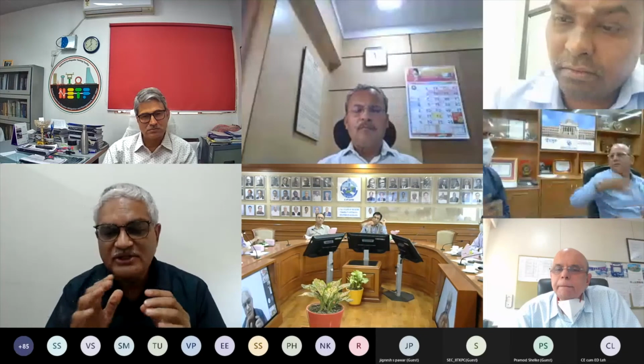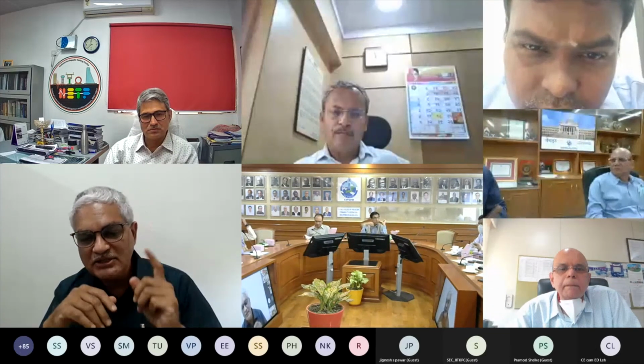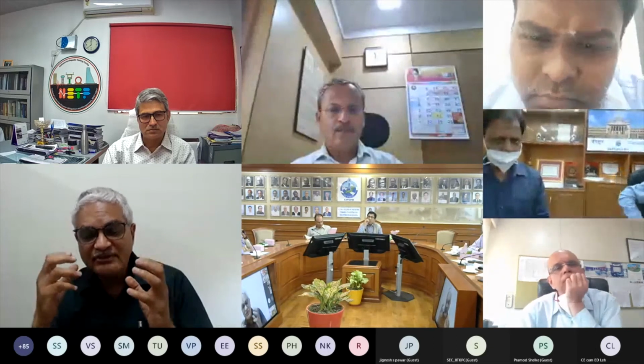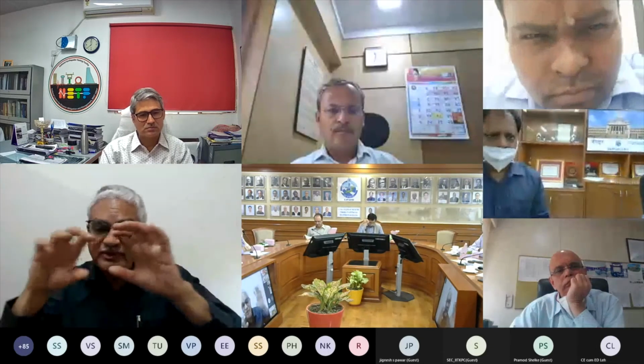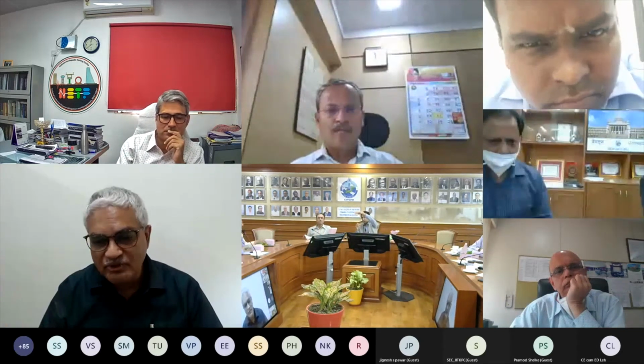Okay. For conventional cast in situ, this is not a requirement. And I don't see that this will come as a requirement. The way we are doing it is we are going by international comparisons of the performance of such structures in other countries during earthquakes and saying whether this is acceptable to us or not. For example, in the Mexico City earthquake in 2017, 66% of the buildings that fell down were flat slab buildings. So we have to learn something from that, and we don't have to rediscover the same newspaper headline in India in the next earthquake. We don't want to rediscover.